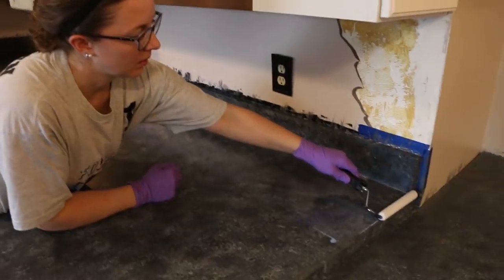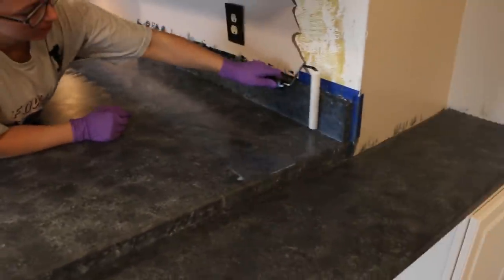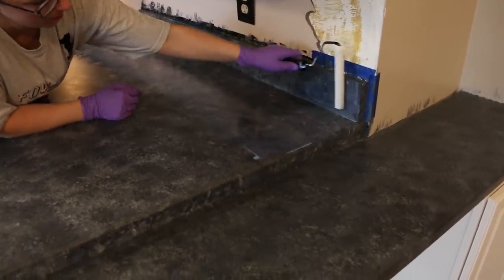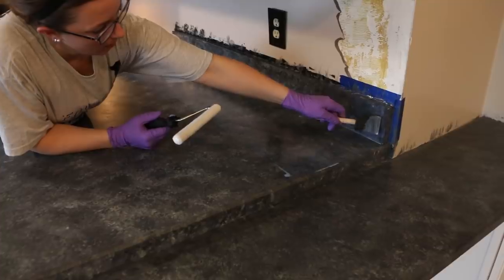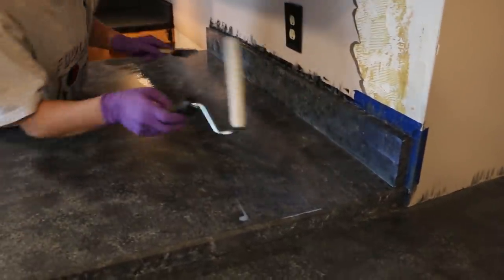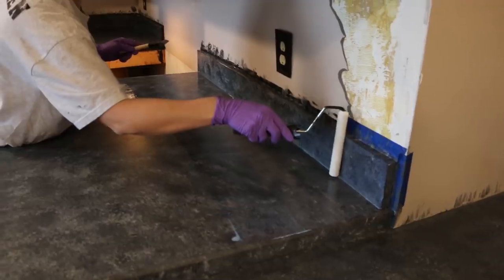You can practice on a piece of paper — just tap on those different colors and use the sponge to give it texture. I think it turned out really nice. Now take the gloss and dip it in, then apply it back and forth. I would start with the boards, back corners, and then the larger flat surfaces. Apply it on and then smooth it out by rolling it one last time. You're going to want to put on two coats instead of just one.